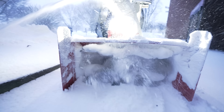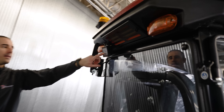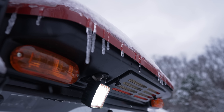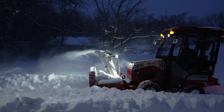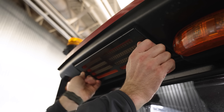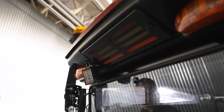Coming over to the back, you've got your rear hazards, a rear work light, and a strobe. This also swings away front and back so that if you hit something it doesn't damage the light. It's all about visibility — when you get all lit up in a snowstorm with snow flying, it's usually at night or in really low light situations, so having light all around you is important for safety. Back here there's also a replaceable cabin air filter — take these screws loose, pull the filter out, replace it, and that helps keep the air inside fresh.